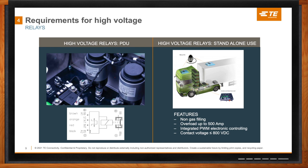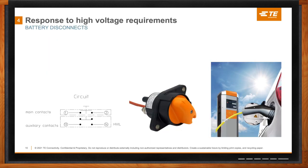Okay, so Mark, when it comes to high voltage designs, battery disconnects can also cause big issues, right? What kind of solution should we be looking at for this issue? Yeah, that's right. For one, high voltage systems have clearly the potential to be life-threatening. A big threat for the switch to switch properly in a high voltage environment is arcing. This happens when there is an electrical discharge through the air between two points. Arcing can cause contact welding and cause the switch to be welded shut. This can be eliminated through blowout magnets or spacing the contacts further from each other.